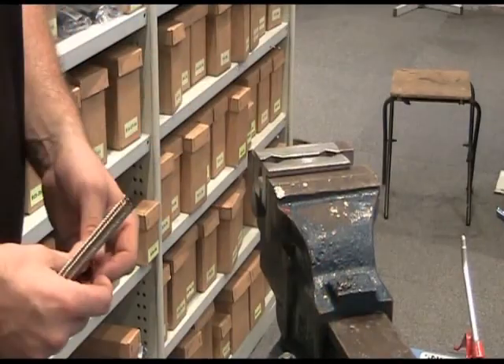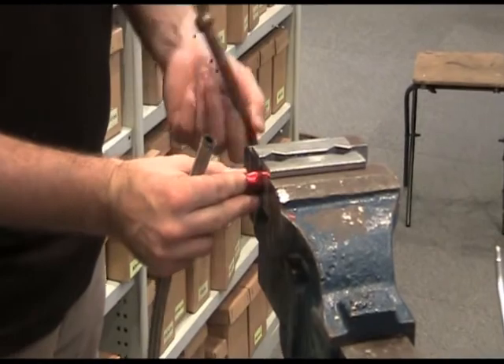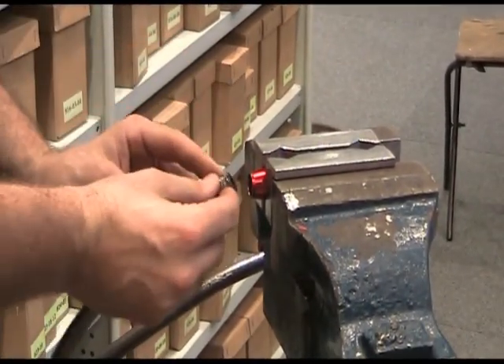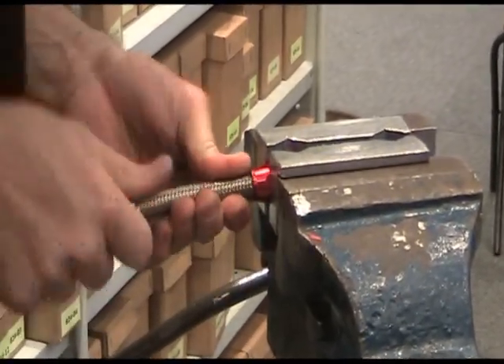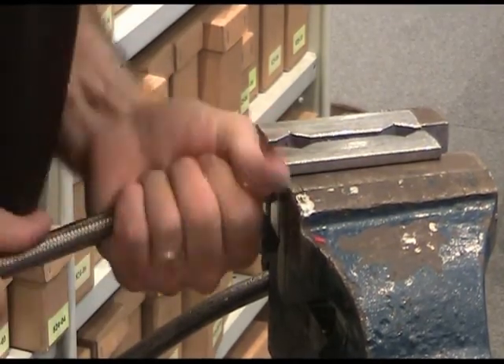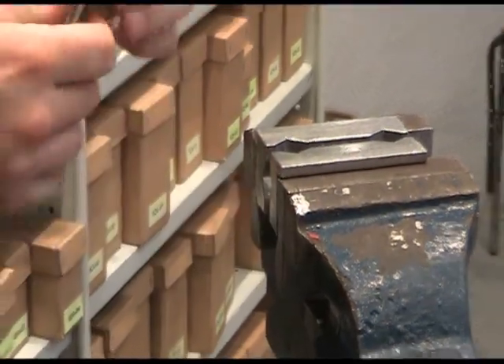These will definitely help in the assembly. With our vise jaws in place, we're now ready to insert the socket into the jaws. Simply tighten these up and you're now ready to insert the hose. Place the bottom of the hose in the socket and simply turn and apply a generous amount of pressure. The end result is the hose should be bottomed out just beneath the last thread of the socket.